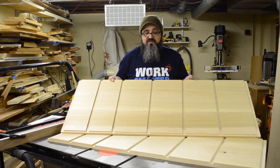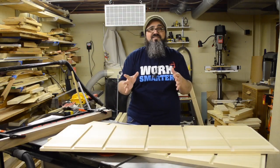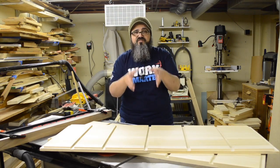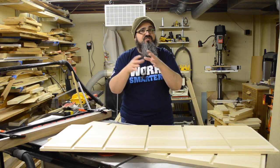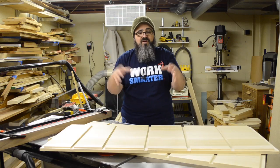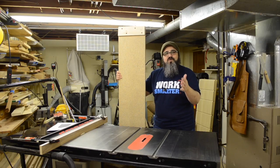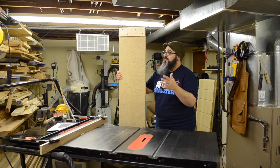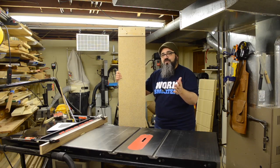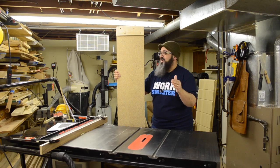The way I ended up doing that: there are a couple of techniques we could have done on the jointer, but instead I opted for a thickness planer sled. Let's take a quick look at the sled I used, then I'll show you some footage of how we ran it through. We could have run the boards over the jointer, but that would mean all those extra glue lines — I really did not want to do that.